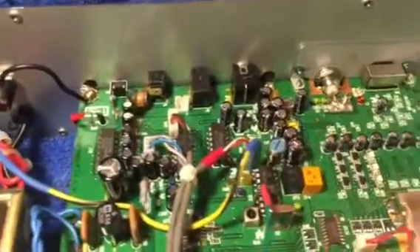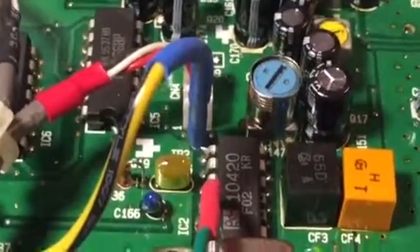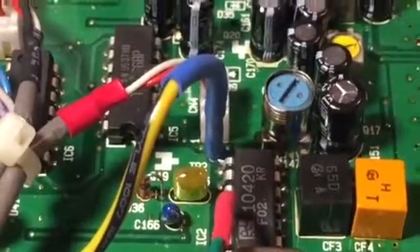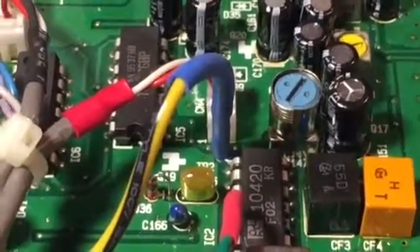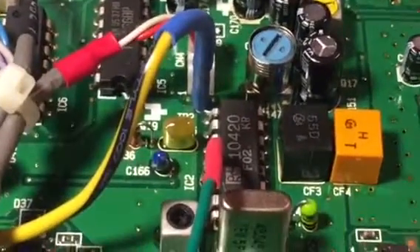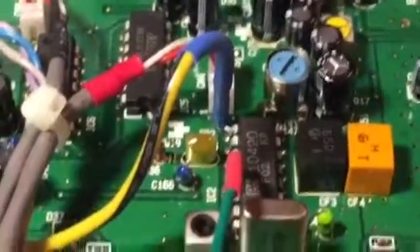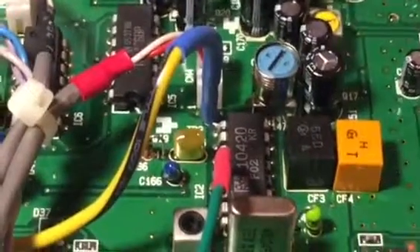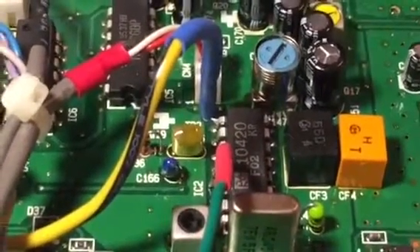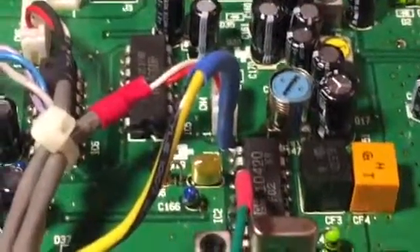If you have this particular scanner, I'm going to try to zoom in and show you exactly where you make the modification. Right here you will see in the yellow wire a blue covering — that is what is touching or tapped into test point 2 or TP2. You'll notice that it's right behind the 10420 IC chip, known as IC2. There's a direct tap to the IC, but I chose not to go that direction. I went to test point 2, which is going to the IC chip anyway, directly.